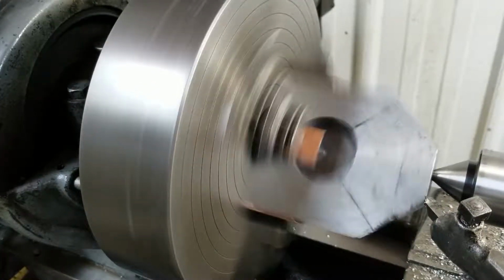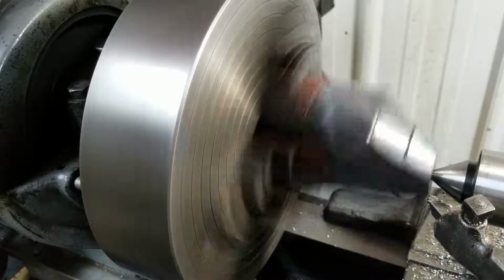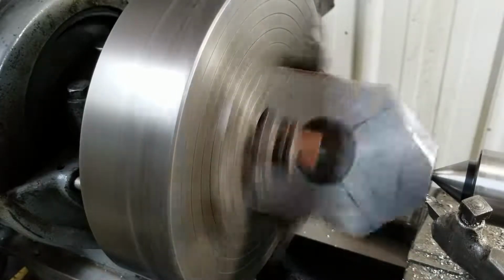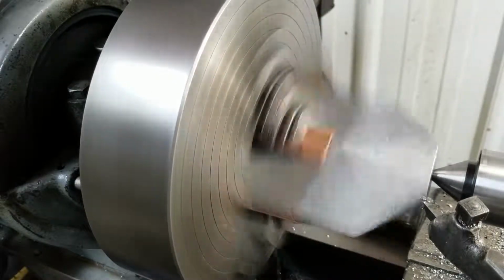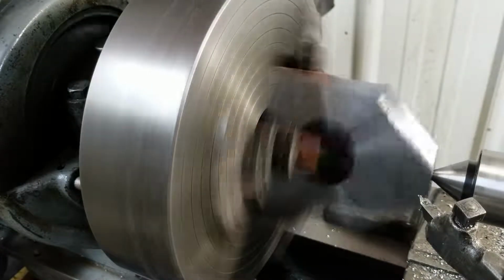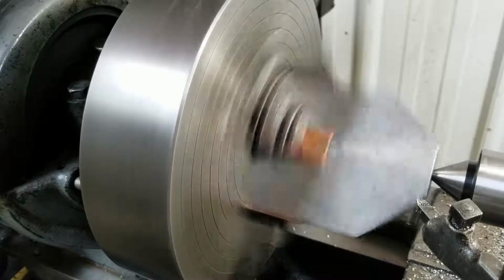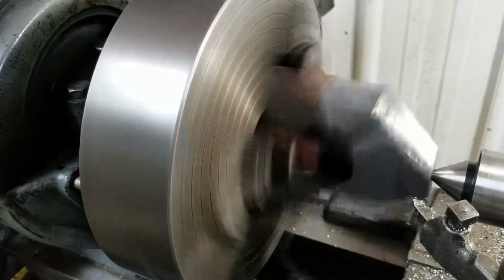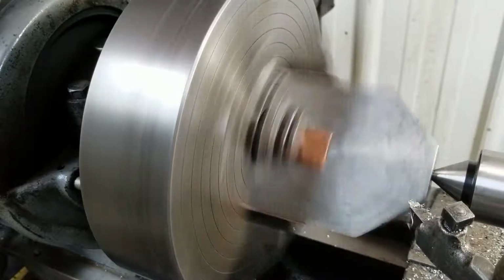I don't have any left-handed tools. I think a left-handed tool would be called for here, I'm not sure. Yeah, we'll try 15 thou since it's supported. I took the opportunity to sharpen the tool as well. I think we're only hitting one side of the work right now, so once we accommodate a 45 on both sides, I think this will go a little smoother. This is working much better than the other setup. Try to pick up the pace a little too.